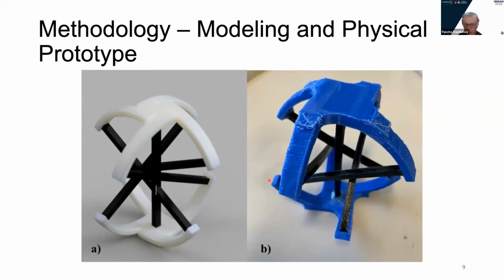Several of those joints can be used together as a stabilizing mechanism for small displacements. Also, it can be used as an actuator in different planes of motion, as a universal joint in different perpendicular planes, according to rotations around the X and Y axes. We haven't illustrated any example because we have to further optimize the design.